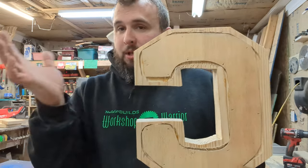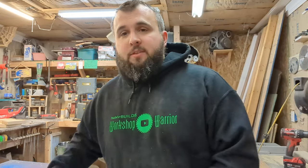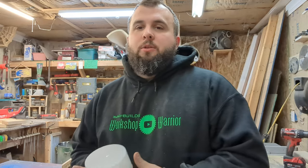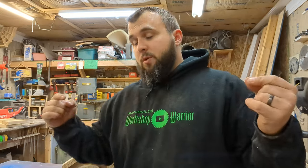The back does not look great - I have all these gaps and things didn't line up very well. My plan to combat that is automotive Bondo filler - it adheres really well to wood, it's easy to work with, it's sandable, and it dries fast. I'm going to paint the backs black instead of staining them, stain the front, then put the acrylic on. I'm going to mix up some Bondo right now while the shop warms up.